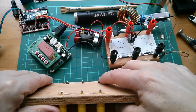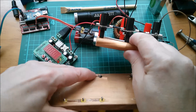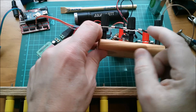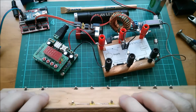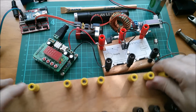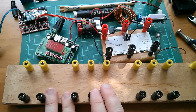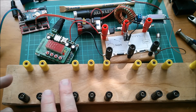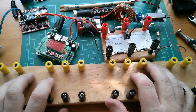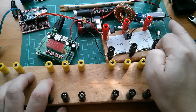So I thought if I group them in groups of three, and on the bottom I've cut these short — because they did protrude a bit far — I've done it slightly differently this time. Last time I just sunk the metal thread into the wood; this time I've drilled larger holes and sunk the plastic thread into the wood. So what I can do is run some wire in a figure of eight around there and solder that on. These will be grouped at one-inch pitch, and across a two-inch span there will be a break so I can connect components.